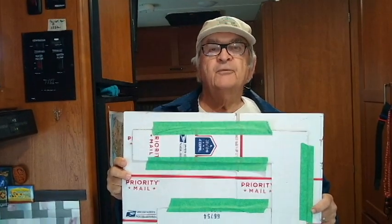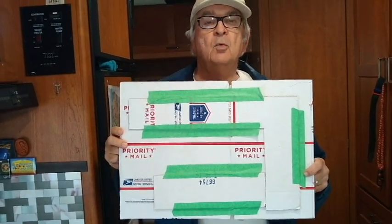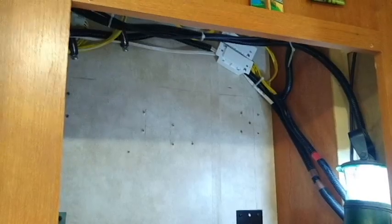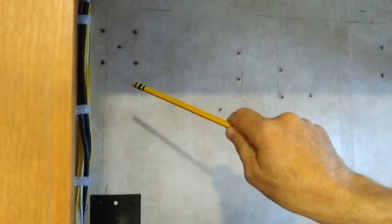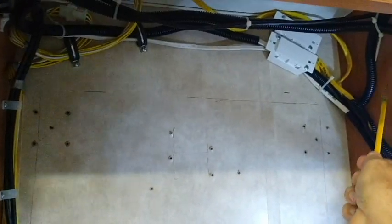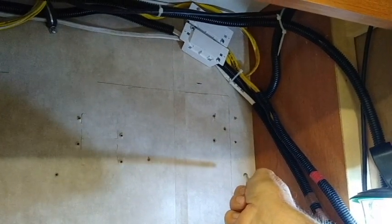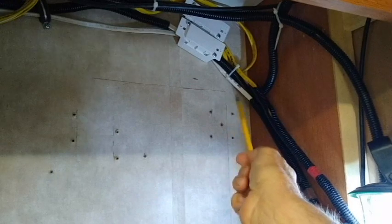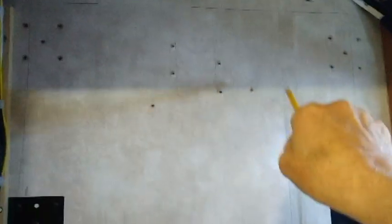What I made was a mock-up of the full size of the profile of the convection microwave, so that I would know where I could move my wires to and set my clearances inside of the cavity for it. As you see, I have taken and outlined the back where it's going to be, and that allowed me to set my safe areas for moving all of the wires out of the way. This side is a cold side — I've tested the convection microwave outside and this side does not get hot. It's still going to get a little heat shield, and I'll still maybe tack down this one wire, but otherwise all the wires are more than an inch away from the back edge of the microwave.